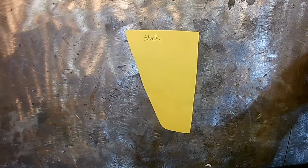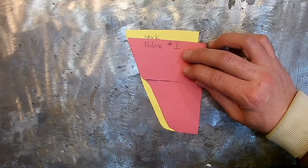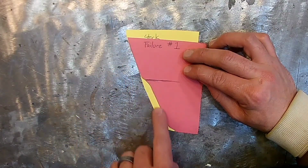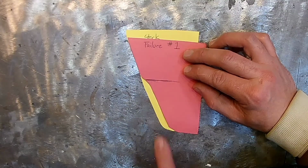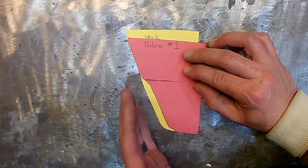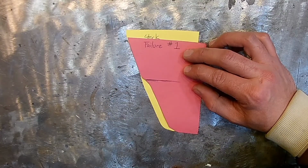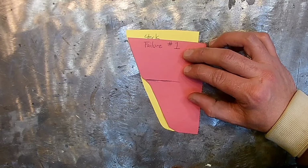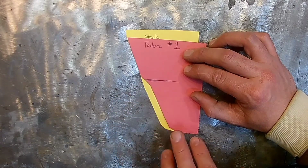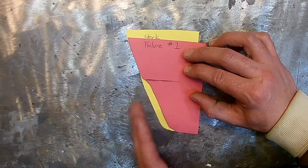Well, that first time I finished it and I considered leaving it alone, this is what I had ended up with. So I ended up with this large quarter-inch jog just in the middle of it, where it just simply tucked in really far. The seam was along here, and everything just sort of pulled in tightly all the way around that corner. And while I considered leaving it because it was at least partially hidden by the bumper, I didn't learn anything. I'm not learning to do this stuff better, so I had to try again. But this is what that looked like to me, even though you can't see it on the camera. So that's when I cut everything apart and started hammering it all out.